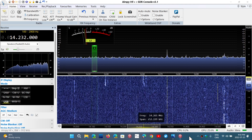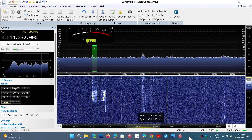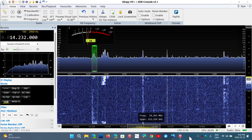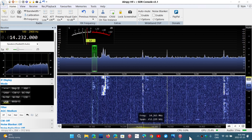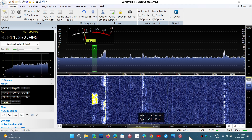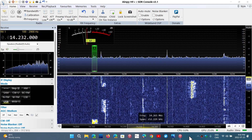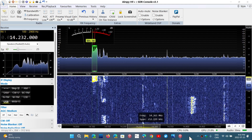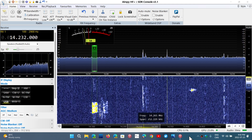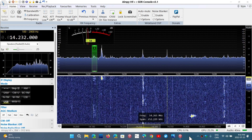If I had to choose between the two, in my personal opinion, a few things set them apart. If you want a wide band receiver that can be used for VHF and UHF, you'll definitely want to go with the SDRplay instead, because SDRplay goes up to 2 GHz. The AirSpy HF Plus Discovery has a very limited VHF range — it's not really meant for that. You'll use it more for HF, medium wave, and long wave.